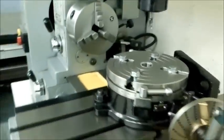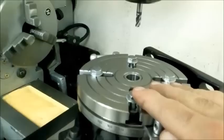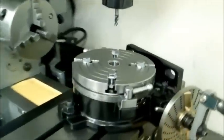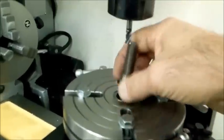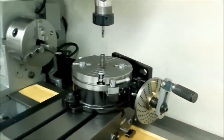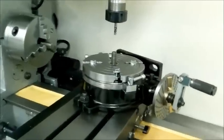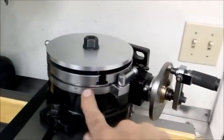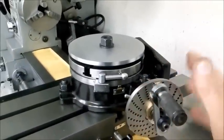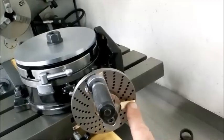You definitely want to make sure that you've got enough cross-slide travel for whatever you want to do. I've installed my spacer bolts here, making sure that they're clear of the area that I need to drill through, so now I'm ready to put my center bolt in. I've finished centering my plate on my rotary table — I need eight holes equally spaced, so that was done with the 20-hole plate at 11 and 5/20ths turns. I got this all set up for that.